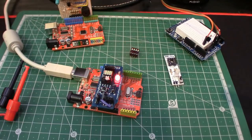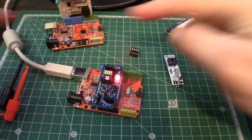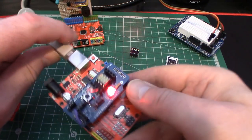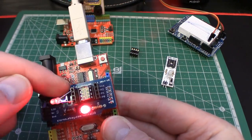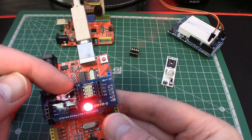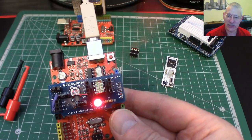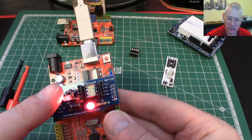Let's see how this is done. If we zoom in a little bit on the actual board itself, you can see that this LED is connected to pin one at the top and pin four which is ground at the bottom. Pin one right at the top is in fact normally the reset pin. So the question is: how does that all work? How can we be flashing an LED from the reset pin?